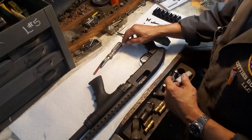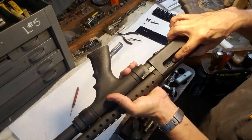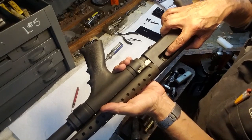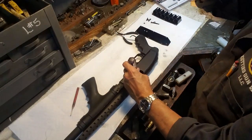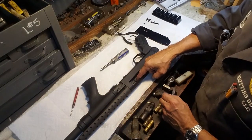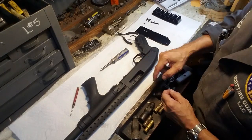There's a little screw on the inside here. On the Mossberg Model 500A, when you rack it back, you can see a little screw right there — what that screw does is it holds the ejector in. So the first thing you're going to do is take that screw out. Just need a good fitting screwdriver. As you're taking this out, just make sure that ejector stays flat, because this is basically a flat piece of tempered spring steel with an ejector bent out on it. The important thing is that you make sure that thing stays flat.